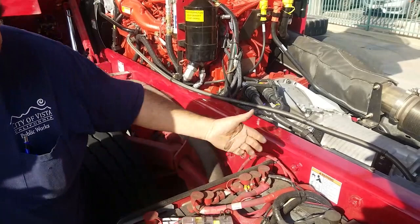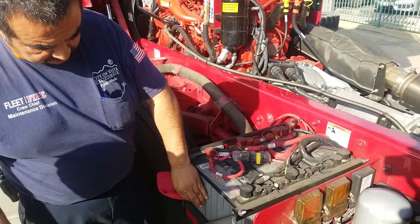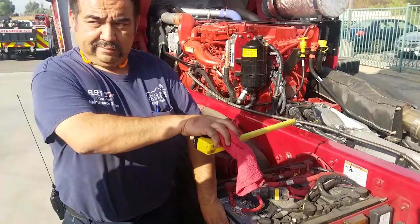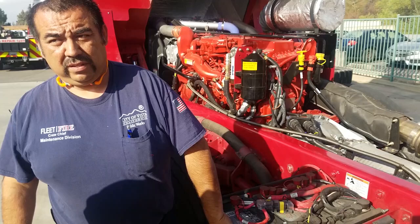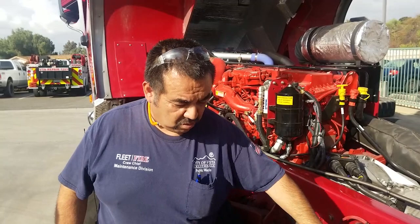Make sure the batteries aren't expanded from overcharging. After a run, you can put your hand on them — if it's not room temperature and it's just one battery that's hot while the others are the same temperature, the problem is probably with that battery. If you have cold, cold, hot — that battery has something going on. If it just looks bloated or swollen, call us out. We keep the batteries for these trucks on hand.